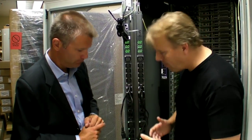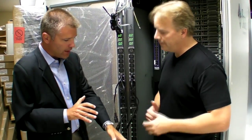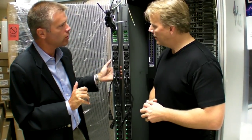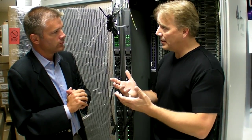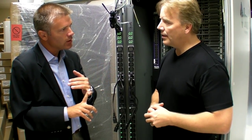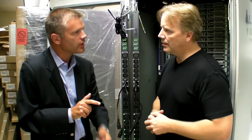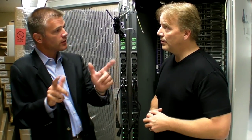In terms of overall power, this unit has an L2130 connection, so we're getting about 11.6 kilowatts max per PDU at 208 volts. You can go to 60 amp and get just over 21 kilowatts at 208, or you can go to 415 volt three-phase and get 22 kilowatts through a 32 amp architecture — 30 amp domestically, 32 amp internationally.